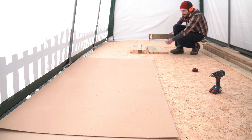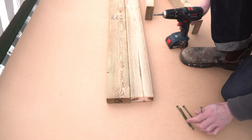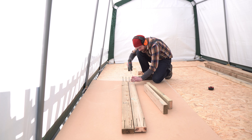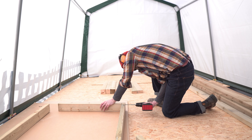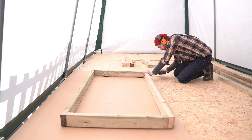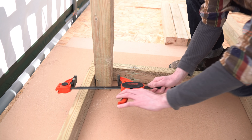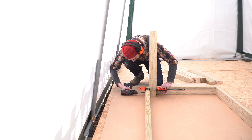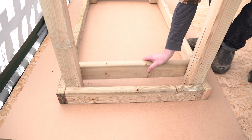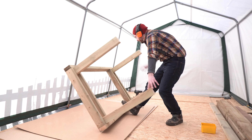My new floor is nice and flat but I've put a bit of MDF down as a work surface and some sacrificial hardboard on top of that, so I've got something really flat to work off. I like to get my screws pre-driven in first and then start laying the bits out. The frame goes together pretty simply with just a couple of decking screws driven in from each corner. Then the legs go in the corners — I temporarily hold them in place with a clamp and get a couple of screws into each one to lock it into place. The extra pieces I cut the same length as the ends go in here, get screwed in, and really lock those legs into place to stop the table racking.